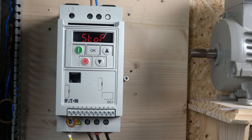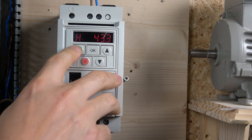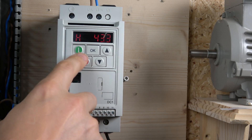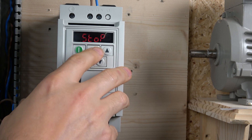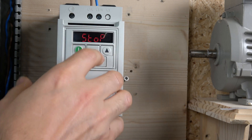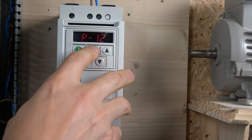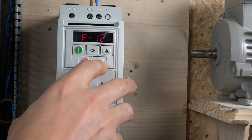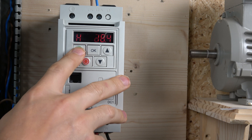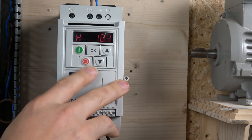Using the acceleration setting and the up/down keys you can control speed smoothly. If you click start again while running, nothing happens — but if you want to run in reverse from the front keypad, go to P12 and change it from 1 to 2. Now when you click start and click it again, the drive will go in reverse. It's a bit unusual having to press start twice, but that's how it works.